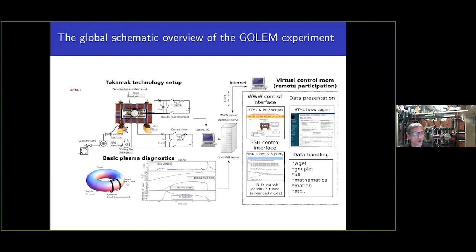Here is the global schematic overview of this tokamak. In the center of the experimental setup there is a tokamak surrounded by necessary infrastructure components. We have to evacuate the chamber and introduce working gas into the vessel. Then we have two electrical circuits: one responsible for generating the magnetic field to confine the plasma — since a tokamak is essentially a magnetic bottle.